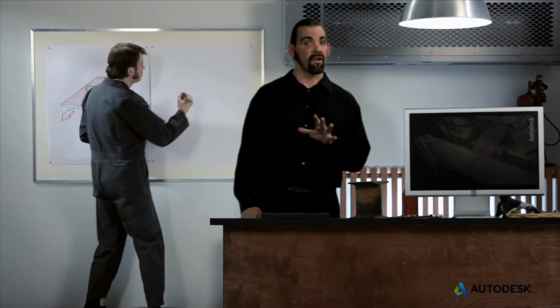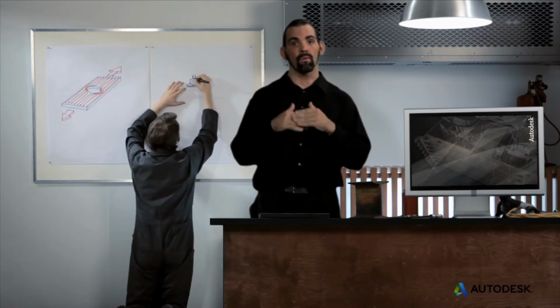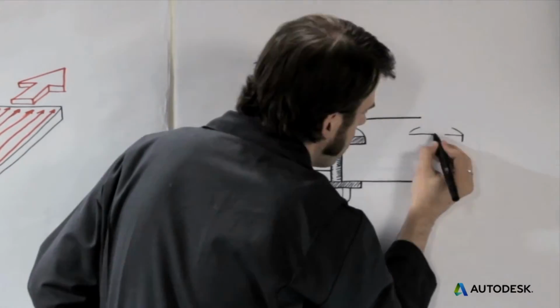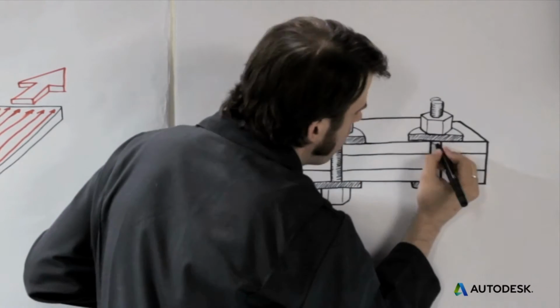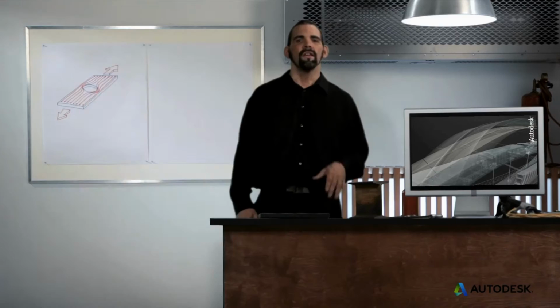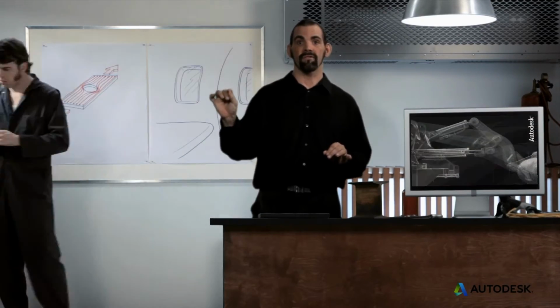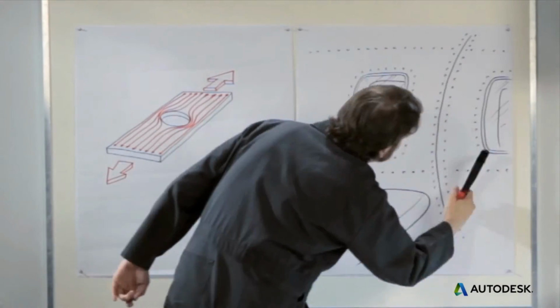Stress concentrations around holes are why you should be careful when you connect flat parts together with bolts or rivets. Ever wondered why you use washers with bolts? Part of the reason is to help distribute stress and add reinforcing material so the rest of the material can be thinner. You can distribute the load more evenly with a lot of small bolts or rivets rather than a few big ones. You can see this on airplanes and the Golden Gate Bridge.